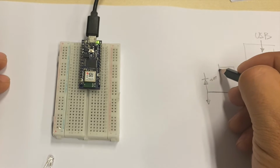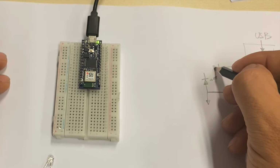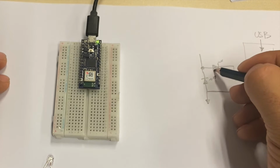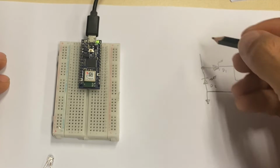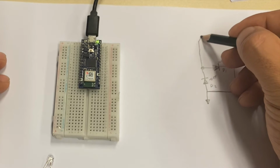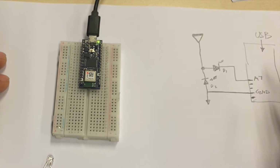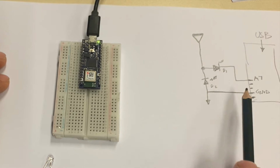And despite this polarity of the diode, this is going to be useful for me. And I connect these two diodes together. So maybe in this drawing I will call them diode 1 and diode 2. And here I can put either a coil or a little quite open triangle symbolizing one of those old style antennas. So with this circuit right now, I have an EMF detector.